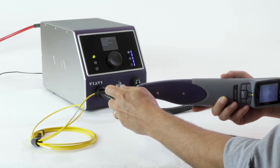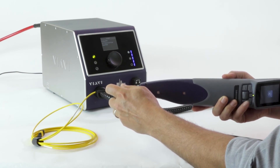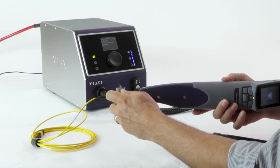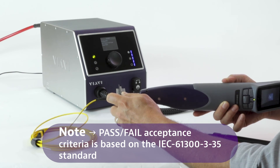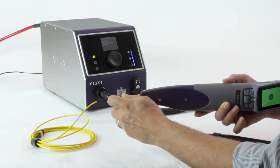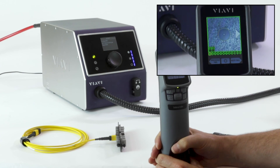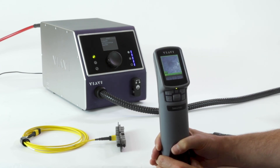Go back live and get that in focus. Now let's initiate a test. This is running through all 12 of those fibers evaluating against the IEC 61300-3-35 standard for fiber acceptance testing. And sure enough, all 12 of those fibers are clean now. That's an overview of the CleanBlast Pro being used to clean both the patch cord and the bulkhead sides of an MPO connector.